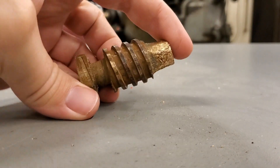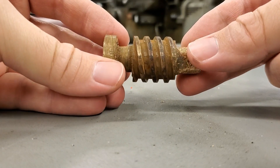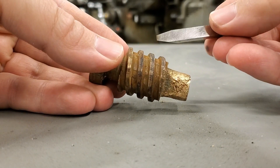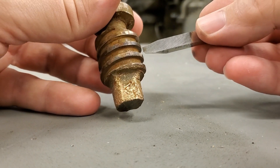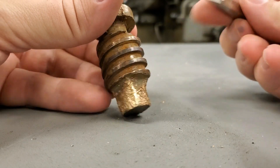Hello everyone. I have to make a couple of new valve stems for the plumbing shop at work, and this has a double-start stub Acme thread. I took a tool that I had previously ground for Acme threads and just repurposed it a little bit and reground the tip so that it would fit into the threads that are here. I just use the old part as my template.